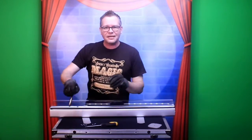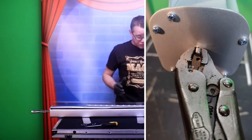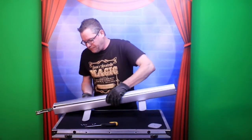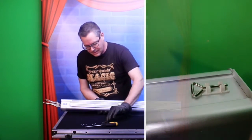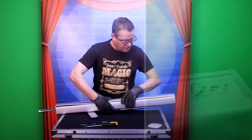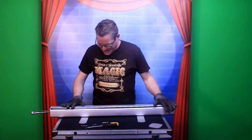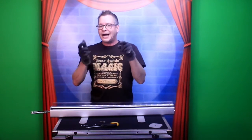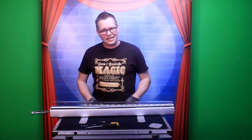I'm going to take a small pair of vice grips and put them on the end to keep it from pushing out. Now — I have to back up because I actually took the wrong end off. We want to take the flat end off, not the knob end. You'll see why when we get to the pin. So put that back in first, and we'll work with the flat end.